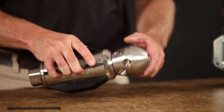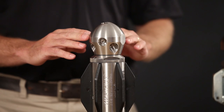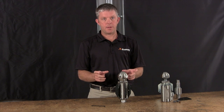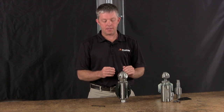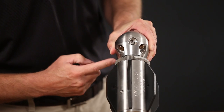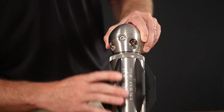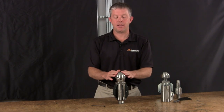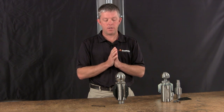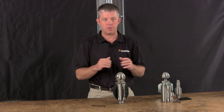For the WGR tool we're offering two standard head styles: a standard head and a pulling option. Both have the ability to be converted into descaling-type heads. A new tool out of stock with a standard head has the jetting configuration you're used to from the WG-1, but it also has port plugs that can be changed to turn it into a descaling head. Consult the online jetting application or talk to a StoneAge service rep to choose the right nozzles and get the most versatility out of one head instead of needing multiple heads in your toolbox.